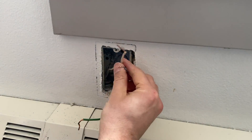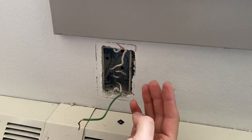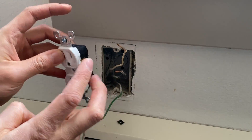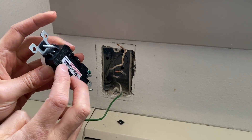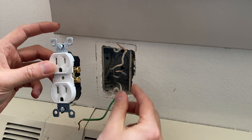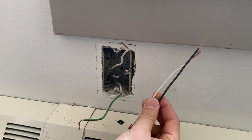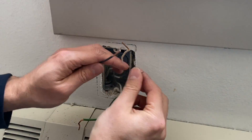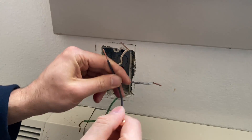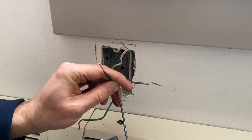There are times you will have an electrical box with one pair of wires, two pairs, or maybe even four pairs, where they could be connected straight to the outlet — two on side terminals and two backstabbed to the back. If you have anything more than just one pair, I would suggest the pigtailing method, which is connecting all the black wires together with wire nuts and then just feeding the outlet. You should have only one pair of wires going into the outlet.